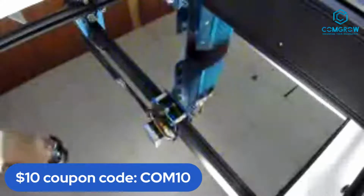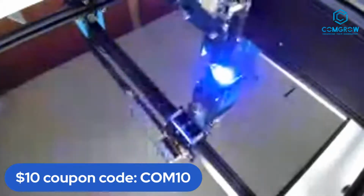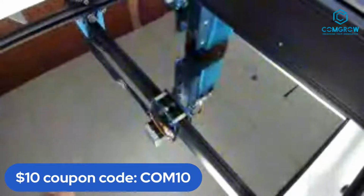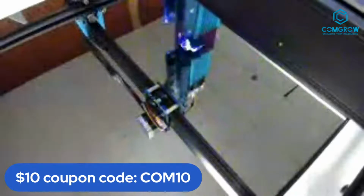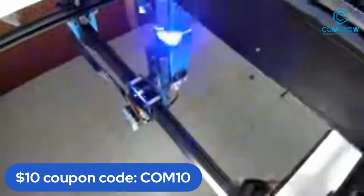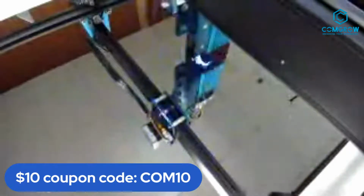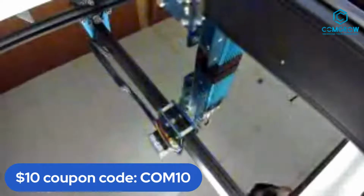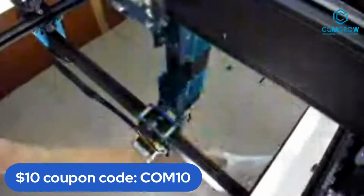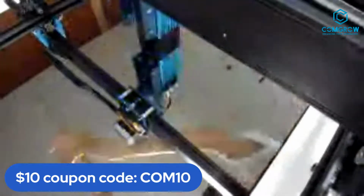Because our laser head has an acrylic cover around the laser, most of the time we don't need to wear laser goggles. But for more safety, in case some light gets out, we wear them now. This acrylic cover can protect against wavelengths from 200 to 450 nanometers. So if you do not watch from the back of the machine, you don't actually need to wear the goggles.